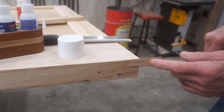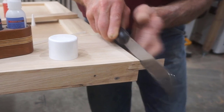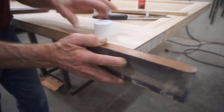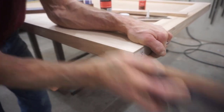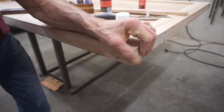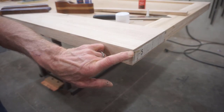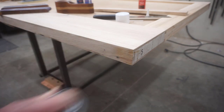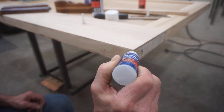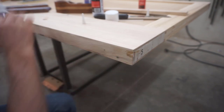That piece is attached very firmly after just a few seconds. Next I'll take this little Irwin pull saw and cut off the excess repair splinter material. I'd like to use a block plane on this, but because everything is so thin, slivery, and splintery I'll resort to sandpaper. I'll use sandpaper attached to my best blocks for demanding sanding, starting out with a sharp 80-grit belt on this block. There's still a little roughness in the texture of the wood, so I give it another shot of CA — medium this time instead of the thick — and a little shot of accelerator helps it cure from underneath and on top simultaneously.